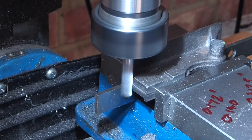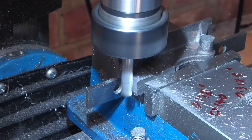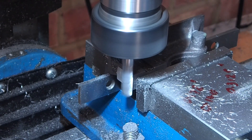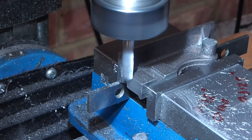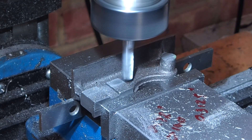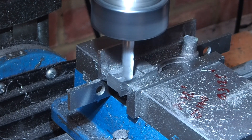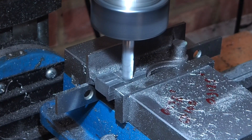The first task is just to machine the end of the frame to length — this is a very simple side milling operation. Next I machine off the port faces, again a very simple end milling operation. Now the recess between the two ports is milled out.